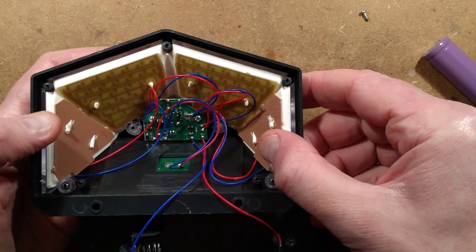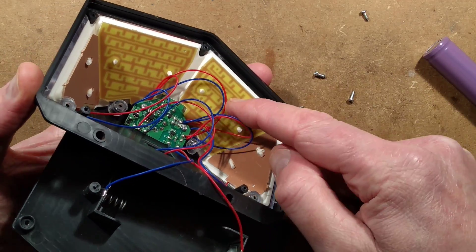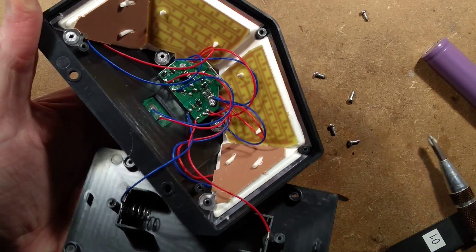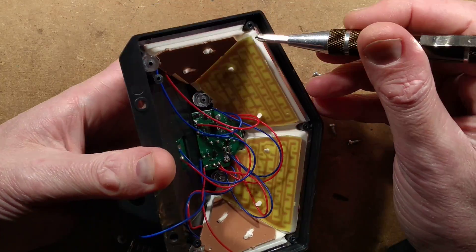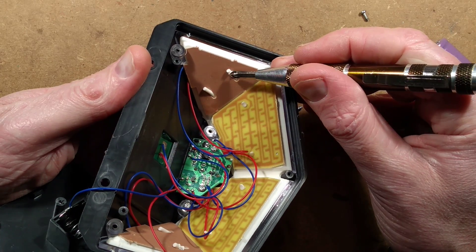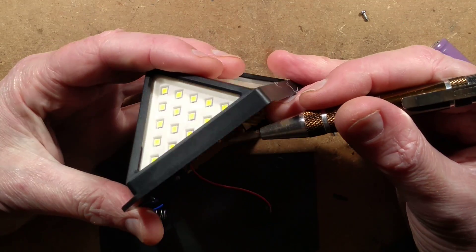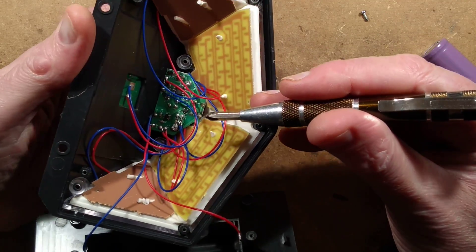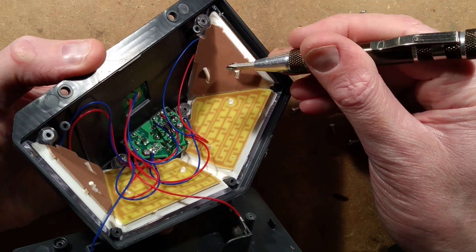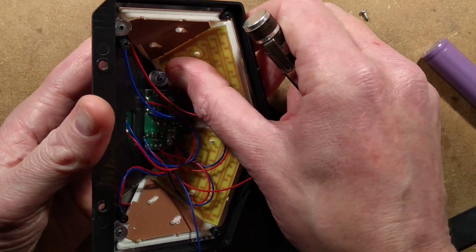Here are the circuit board panels. What's really weird is the back ones — all the LEDs are in parallel. The back ones are standard fibreglass, but these look like resin-bonded paper. Also interesting: because the plastic has been moulded at a certain angle, the fixing posts have slid the circuit boards down. The posts come from a specific angle and they've heat-staked them, sliding the circuit boards on sideways onto these posts — quite weird.